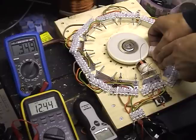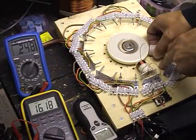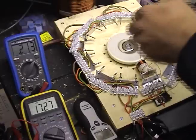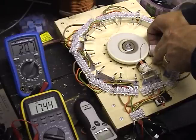Now I'm moving the trigger coil to get an earlier trigger. The amp draw is less than when we started, which is not what you usually have when the trigger coil is on the same core as the driving coil. Now we're up to 17 volts on the second capacitor, which means we have rapid switching.